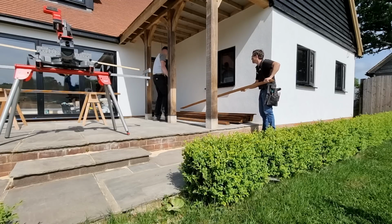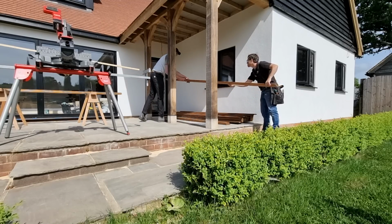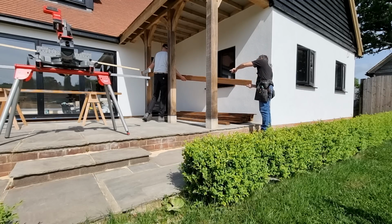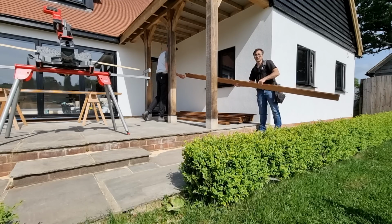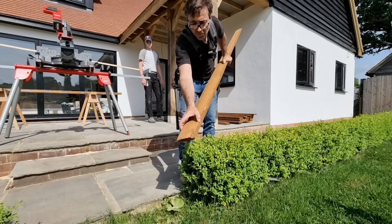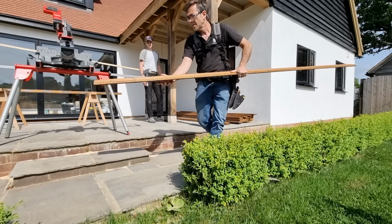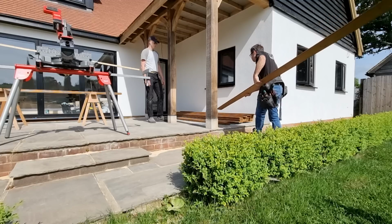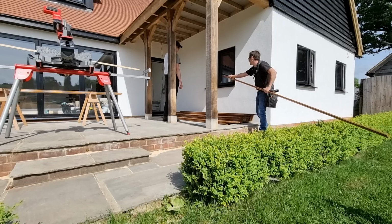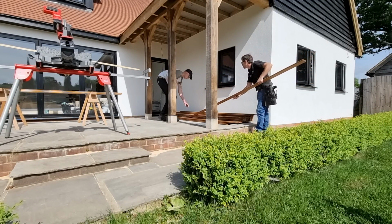That's like an arrow, that one. Beauty. That's a good start point. I mean, they are pretty nice. That one's nice. It's got a bit of a defect on the end, as it was gone through the thickness there. And can you see where the shoulder is? If I just show that to the viewer, it's actually narrowing down towards the end, so that's actually not that true, that one. Look on the back side as well. Yeah, so that one there we'll probably set as a defect for cutting shorts out of. That's got a wobble in it here, that one. It's actually got a wobble in it there. Put that to one side.